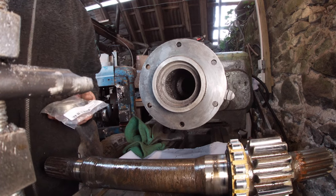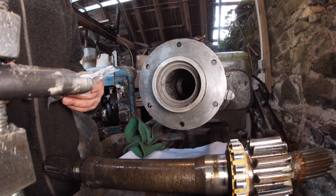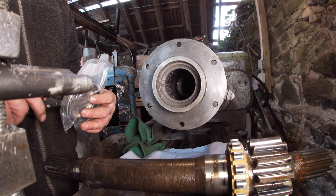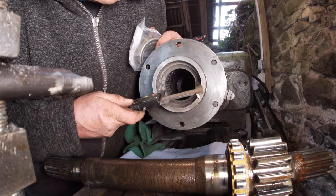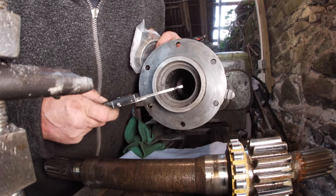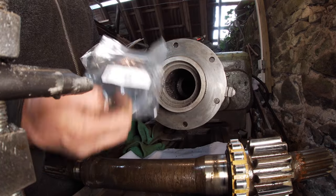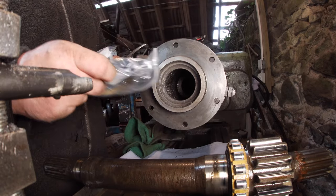Right, found the seals. Yeah, I ground the hub there. The thinner one I got from Mayhill Tractors. So, shaft. I'll just measure the inside roughly. It's looking like 64.47, which is not far off. I think I might take another couple of passes on here. This is the external seal, so it fits no bother. Front goes in front of the bearing. And they're all plastic now.